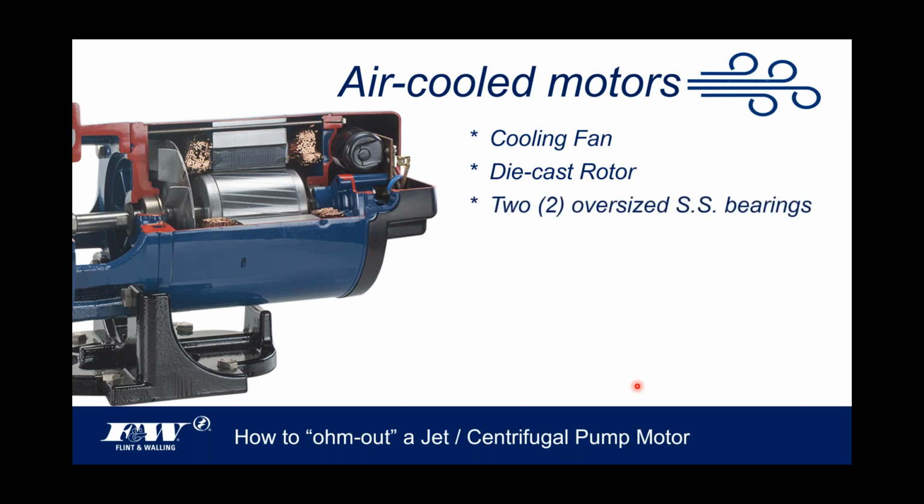That's in there. The two stainless steel oversized ball bearings, one sits up just in front of the fan right there. And the other one sits right behind the rotor in a casing in that casting there. So those, again, two oversized stainless steel ball bearings. Also, you can look in and you can actually see the stator windings. These are the copper windings. And this is what we need to keep cool. We need to dissipate heat away from these windings in order to have an efficiently running motor.